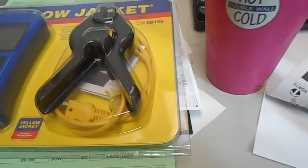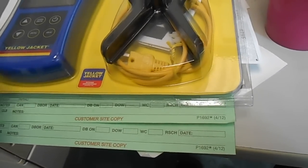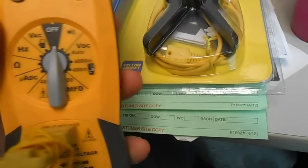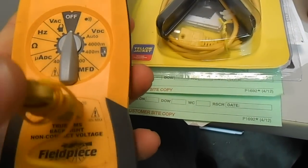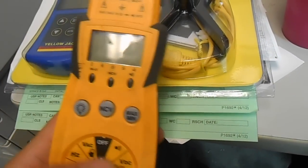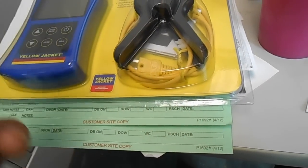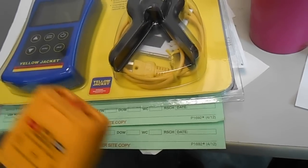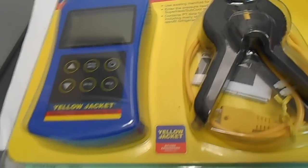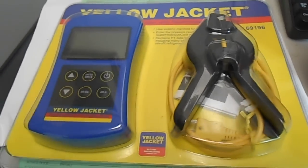Now, I swore I'd never buy a tool like this or digital gauges because I just don't need that. Well, in reality in practice, this has been a very accurate thing for me to get temperature with. But I find sometimes when I'm starting the unit back up after putting the charge back in, I want to look at the amp draw and a couple other electrical things, and I want to be doing my superheat and subcooling calculations at the same time. This gives me most of the benefits of digital gauges and I can still use my analog gauges like I like.